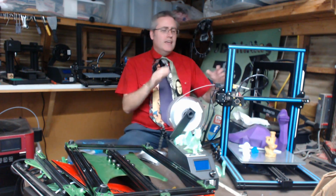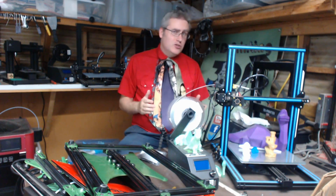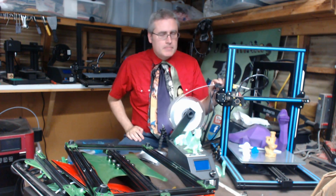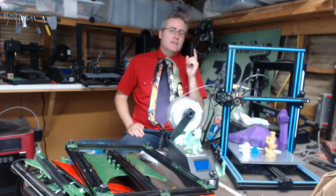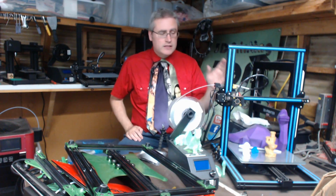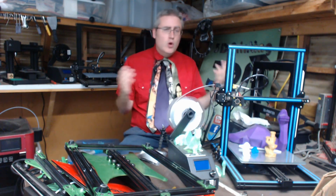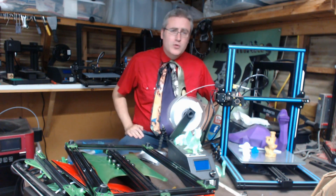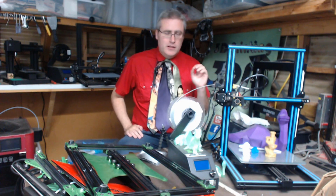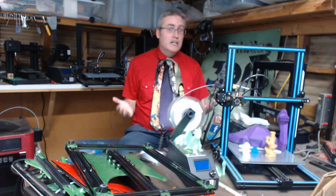So that's a question. Is the CR-10S worth the feature on the firmware that we probably shouldn't be using, the ability to update that firmware easier, and filament runout detection? I don't know. And I'm going to leave that choice entirely up to you. Personally, I think the filament runout detection is worth the price of admission. It's worth the increased price to me, simply because with a big 3D printer, you don't want to run out of material partway through that print. You want to be able to stop the print and add more filament when that happens, because you got a big printer and you're going to be doing big prints, and that's going to happen.